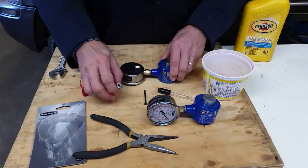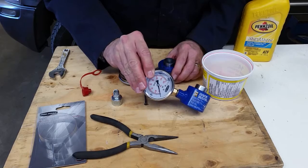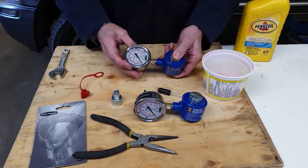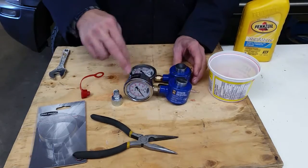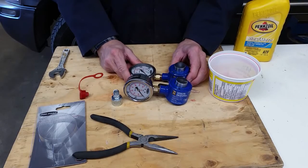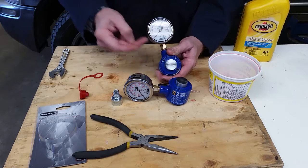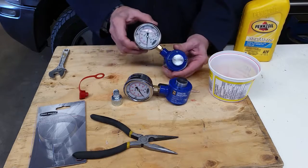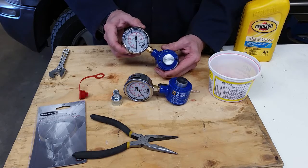Because you only have 2,000 PSI — or approximately 1,800 pounds — if you have anything over 1,800 pounds that you want to measure, you just gang two of them up side by side, take your total pressures, and you can measure something up to 3,600 pounds. And conversely, if you want to change to a higher gauge, you could actually measure something up to four tons. So that's essentially how I built these scales — I hope this helps and thanks for watching.